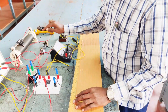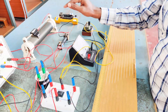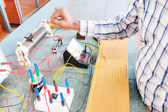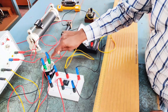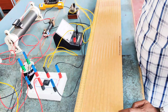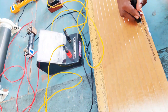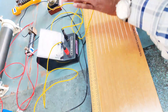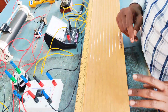To start with, the knob of the rheostat is kept at a particular position so that a particular amount of current I shall be flowing through the series part of the circuit, that is flowing through the standard resistance and the unknown resistance. To check the correctness of the circuit, we keep the jockey at the first wire and also the last wire so that it executes opposite deflections in the galvanometer. Now the circuit is functioning properly.